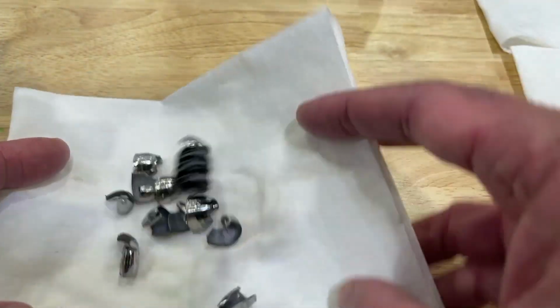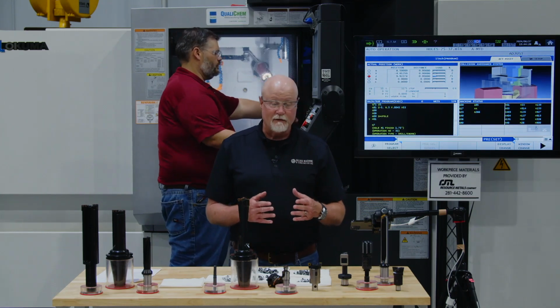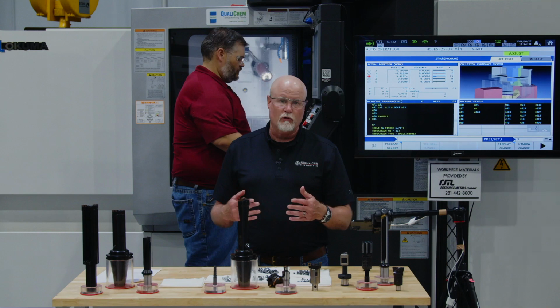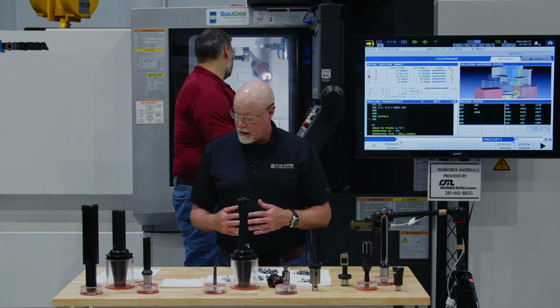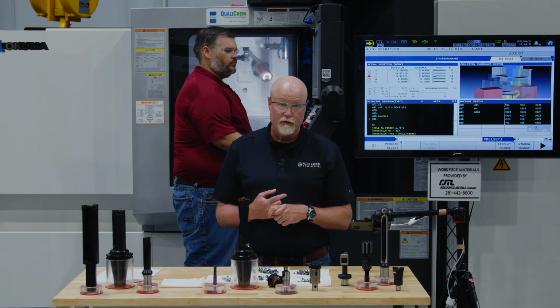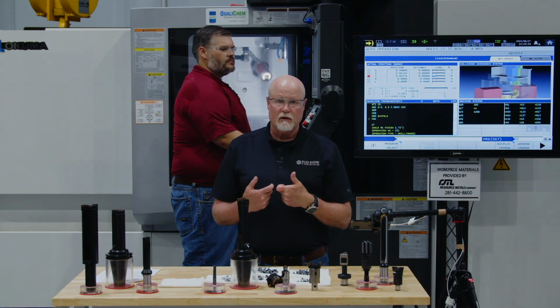Okay, so that's a 1 5/8" Vortex drill running 5 inches deep. We're going to follow that with a twin cutter from Wohlhaupter, so this would be a rough boring tool. We're going to run it at 425 surface feet per minute and 6 thou per rev, and it's on the same level. So this is going to be like a twin bore.